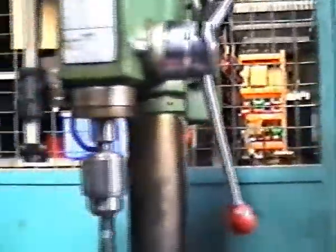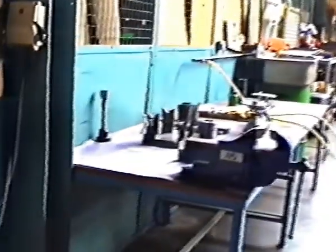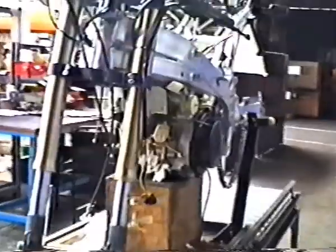All of the rotating parts of the engine are dynamically balanced. So all the rotors are individually balanced on that machine. And on this one we balance the complete assembly, flywheel, eccentric shaft, rotors, balance weight. And after balancing, they're all kept together as a set into the engine build. Unfortunately, engine build is locked and I don't have a key. Can't really see much in there.